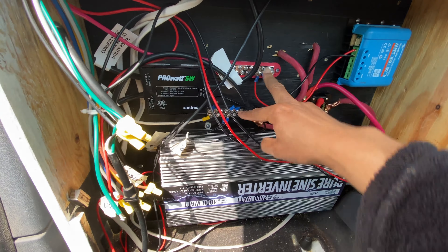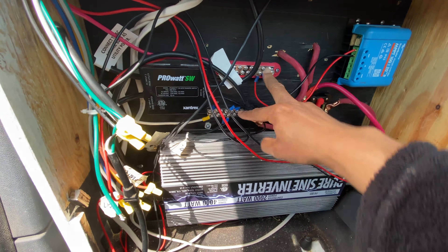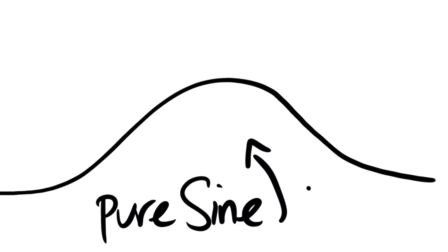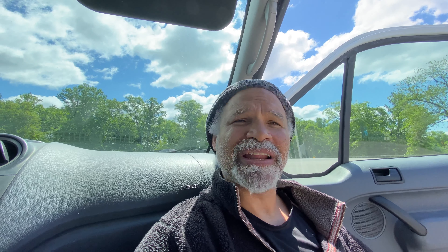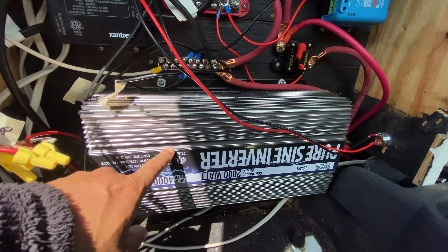You want 12-volt — you don't want to run off of 110 — except when you have sensitive electronics like this guy is handling right now. It allows me to charge my iPad, my iPhone, my laptop, so I don't have to worry about whether or not the charge is right. There are basically two types of inverters: modified sine wave and pure sine wave. Pure sine wave is what most modern electronics absolutely needs. Modified sine wave doesn't care about your electronics — your iPhone or iPad could pretty much not handle a modified sine wave. So you absolutely need a pure sine wave inverter.